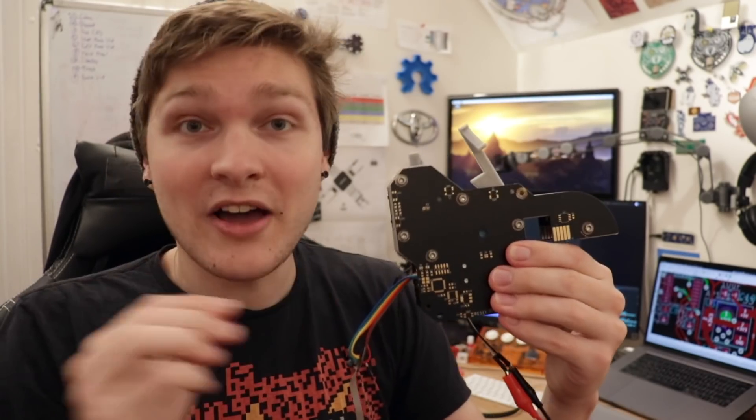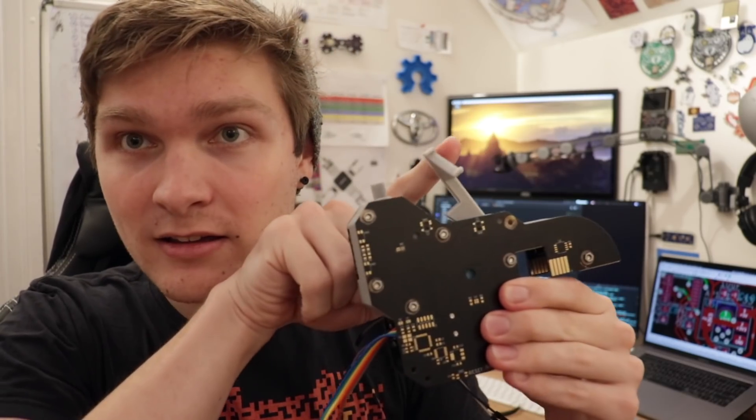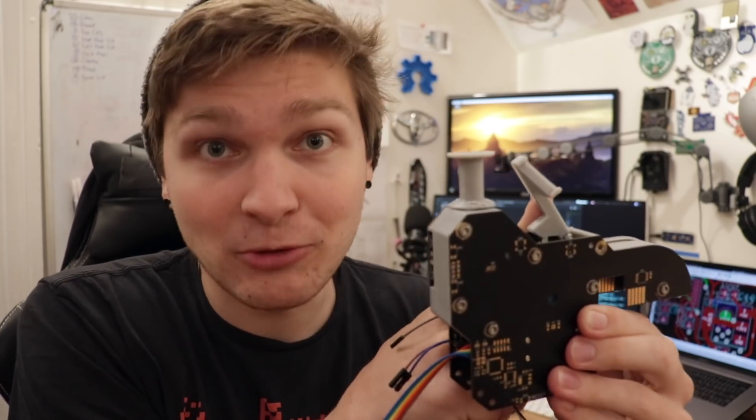All right, it's all together and so far it's all just kind of working. Here's the whole thing bolted together — there's a million cables sticking out the back so I can power, program, and read data out of it. I have some really basic firmware that demonstrates all the different things it can do. First, when it turns on it does a little blinky thing. Then two buttons move the motor back and forth. This little guy moves the top motor — I designed a part with a triangular interface that fits tightly onto the motor spindle, with an adjoining spool that just pops on and will wind up whatever film is on the tape. Tape detection works too — if I put some tape in, it sees it.